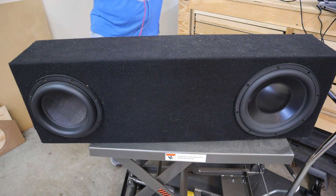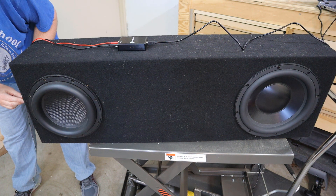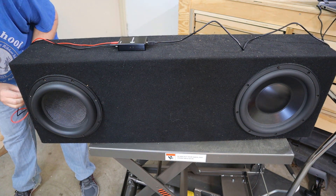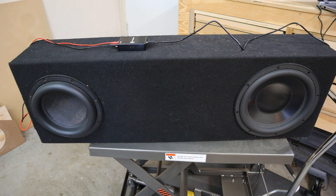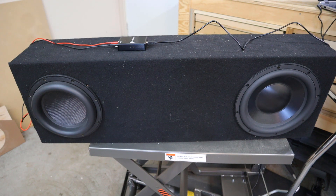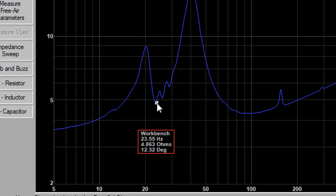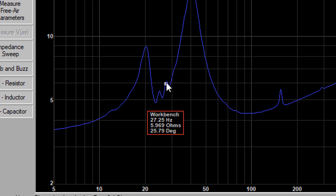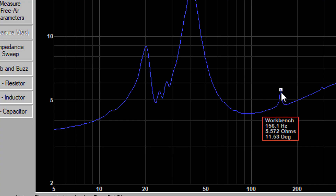Here's the reason why I bought a DATS: I want to verify the tuning frequency of this enclosure — my passive radiator build. On the left I've got a 10 inch Ultimax, and on the right I've got a 12 inch aluminum cone passive radiator. You can tune a passive radiator by adding or removing weights from the back, and the only way to really know how much weight to use is to measure it. When I built this enclosure I was shooting for a very low tuning frequency, and I measured it before filming — the tuning frequency is about 22.5 hertz, which is a hair lower than I was shooting for. But something between 20 and 30 hertz looks odd in the impedance response. This tells me that something has probably shaken loose inside the enclosure since the last time I tested it. I'm going to open it up and check it out.